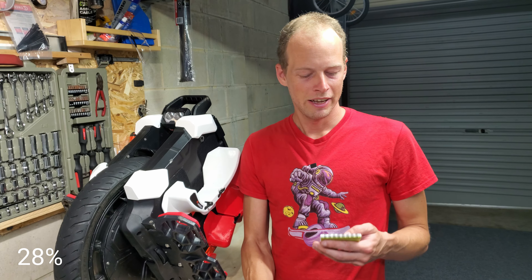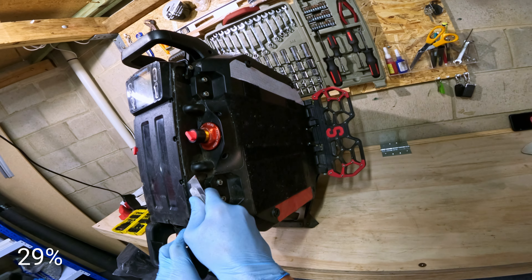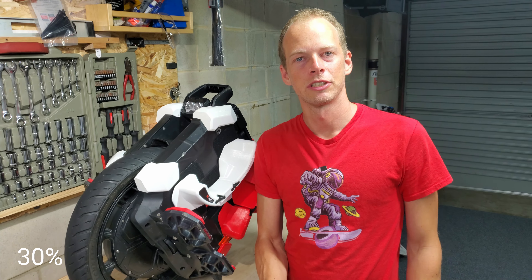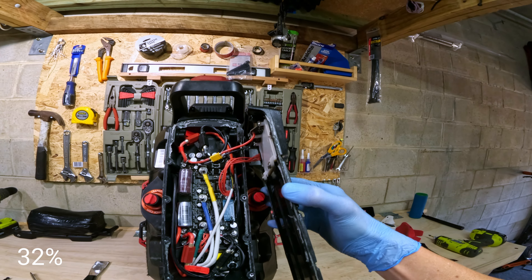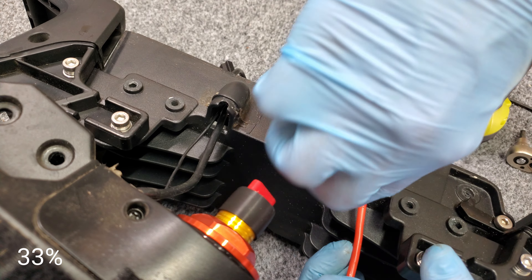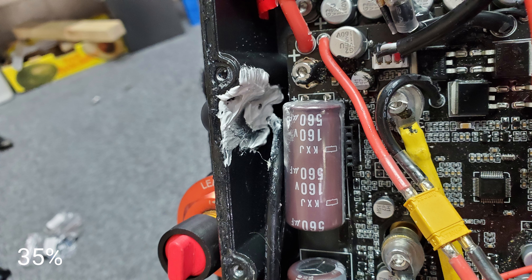Onto the notes for the teardown: I found it was a bit difficult opening up the compartments since it was siliconed, but using a paint scraper I got through pretty easily in the end. I did find there was some light dust on the inside of the electronics — there's a hole where the wires come through that needs to be plugged. I ended up using some grease and silicone, with the grease added so it's not super tight when I come to disassemble in the future.